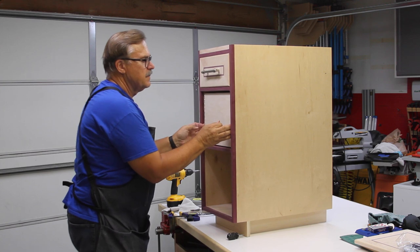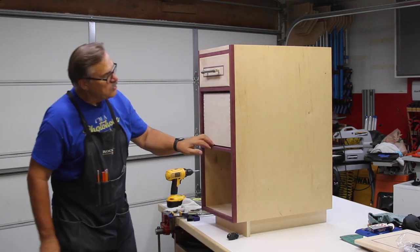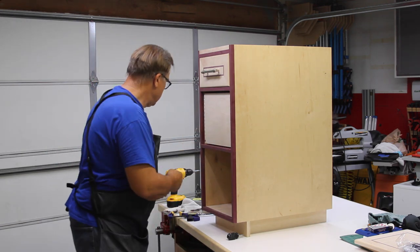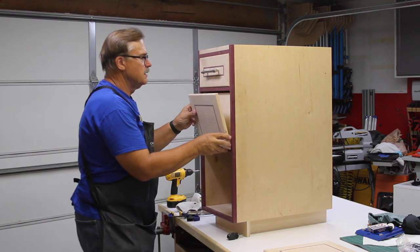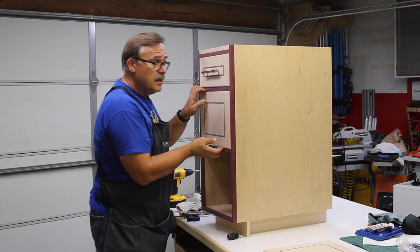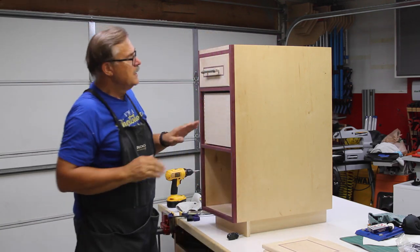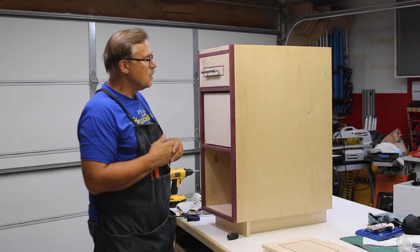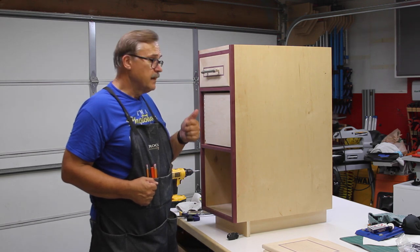Each time I pull the drawer through, those pieces that I bent out are bending back in, and it makes it easier to slide. I have a quarter inch at the bottom — actually a little more than a quarter inch, so I had a slightly bigger gap than a half inch total, but it's perfectly level. The next thing will be placing my false front onto the front here — when I press it back, it has the same reveal. In the next video I'll show the easiest way I have to put the drawer fronts on. Stay tuned for the completion of this base cabinet and how to put the fronts on these drawers.